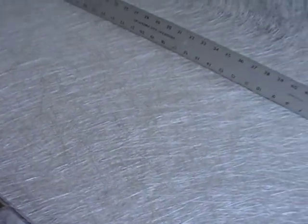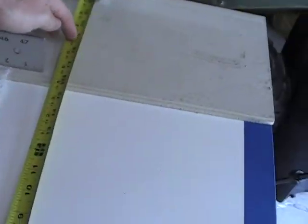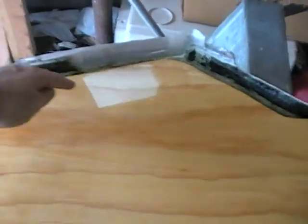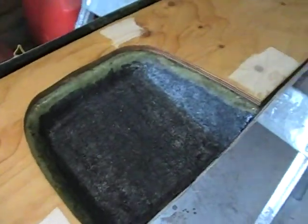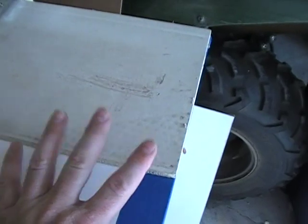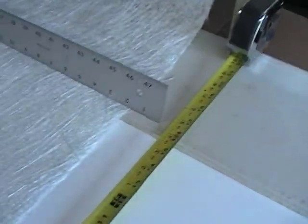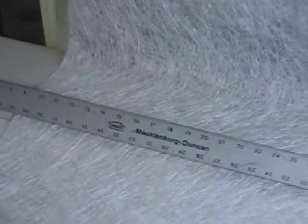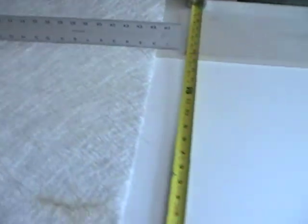Here's my glassing table. I've got to cut some 19-inch pieces, then I'll bring them over and lay them on top, trace the edges, and cut them out following the contours of the swim platform. Pretty simple. I've got a piece of hardy plank laid up on top of my fiberglassing table that I cut on, with a couple of clamps on the end. I pulled my fiberglass off the roll, got it clamped on the ends of the table, and I'm going to measure out 19 inches, lay down my straight edge, and make a cut.